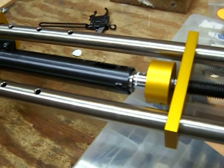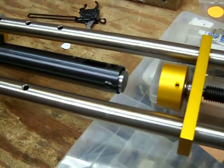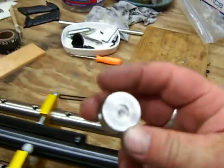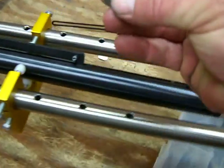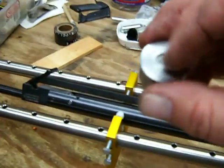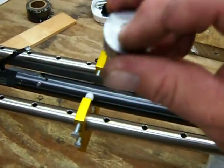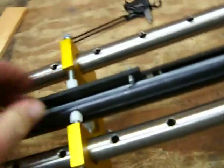That's all the compression there is - not even a quarter of an inch. These right here are very high-quality steel - that's where the piston rod rests right in there. You've got to check that every once in a while, because if your piston starts wearing sideways it'll make your whole piston kind of warped. Check that every once in a while.